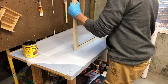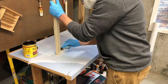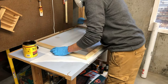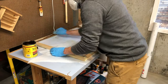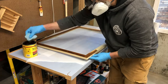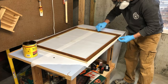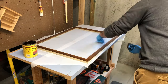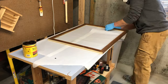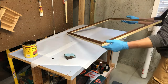This is the honey stain that I'm using — it's an oil-based stain. I'm not taping it off. You can spray it or use a foam brush; this one I'm using just a shop towel, putting on a layer and then wiping off the excess. I'm just making sure not to get onto the inside where the picture is going to be, but on a picture frame it's okay to spill over a little bit. Just going around making sure everything looks nice.